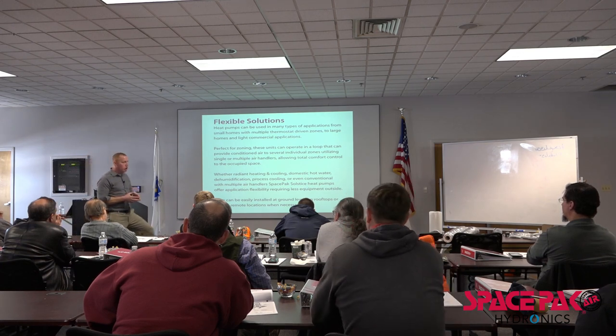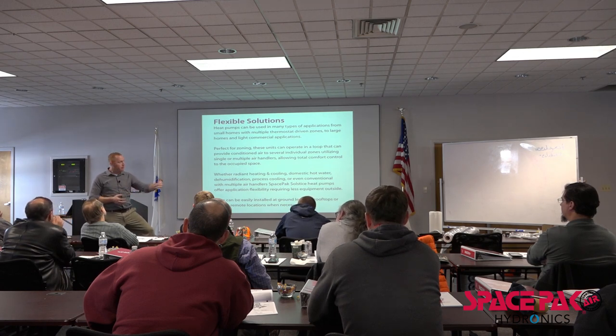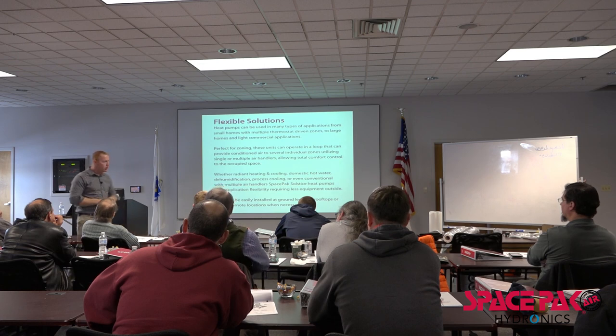Hydronic wise also, who's done some boiler work? Okay? So the same thing, we've got a boiler. Whether we use a buffer tank or not, we've got a low loss header, we come across to our manifold. Every one of those circulators is a zone, right? We can do the same exact thing here, but we can also do it with chilled water. So that fan coil that's getting warm water can also get chilled water. Have to insulate the pipes, and we'll talk about that, but it gives you that flexibility.